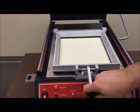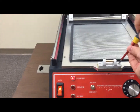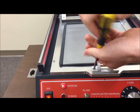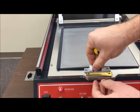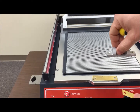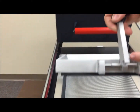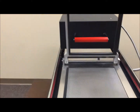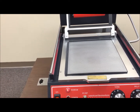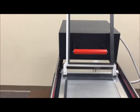But if you did have a leak, what you would do is take a look at the front of the clamp frame and the back. If you have a leak along the top here in the front, you would just unscrew this and you could remove one shim, screw it back in, and test. If you still have a leak, take another shim out. But you don't want it to be too hard to close the clamp frame, because by doing so you'll wear out this piece as well as the clamp right there. When you order them new from the factory, we already test them and there won't be any air leaks. But as time goes by, this rubber does tend to wear and you'll have to adjust accordingly.